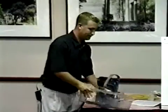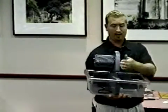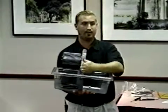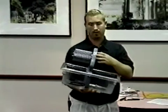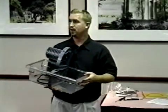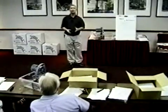So then we take a look at the saw from the front at eye level. If anybody's ever talked to me on the phone, they've heard me say that — I say that all the time. What we're making sure of is that this thing is straight up and down. We don't have the blade in there, so we want to get it pretty close, or we want to use our straight edge. Is anybody's out of whack? Anybody's look like they're off? Let's pretend we've got everything straight.